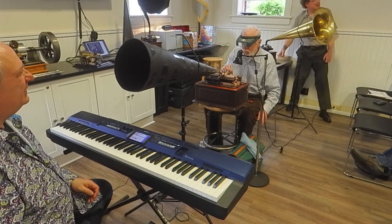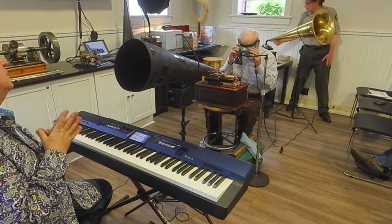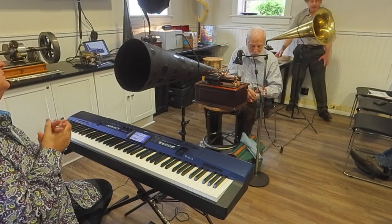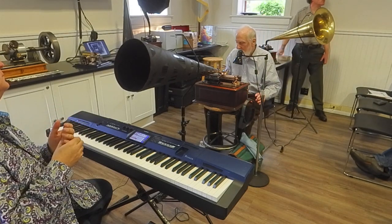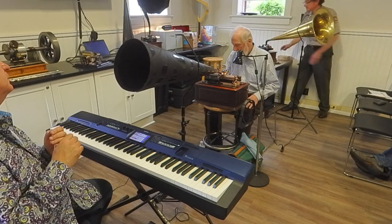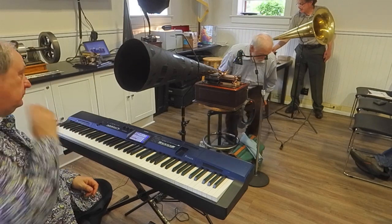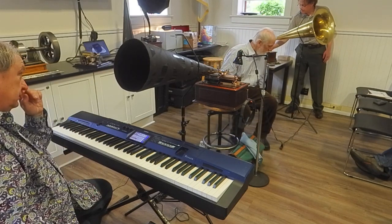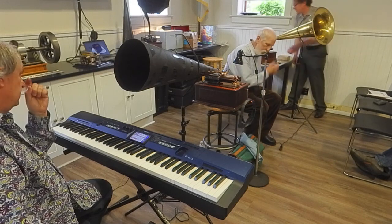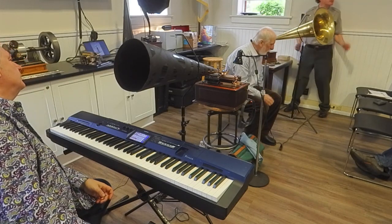What I'm doing is there's a spring motor inside of here that powers what turns the record. They called it a clockwork motor, because it's like an old clock that you wind up. So that's what I'm doing. When I'm turning, I'm tightening the spring. Next, I'll release the brake on that spring, which gets the record turning. You see, it's by pulling. And next part of playback is I'm going to lower the stylus.